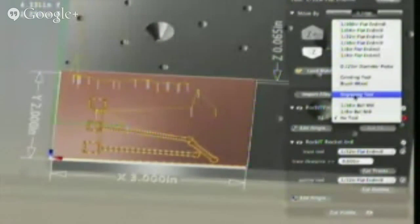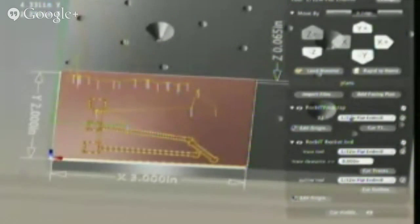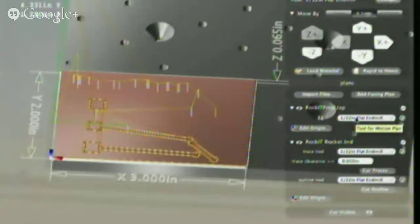So, we're going to import our logo file, which is right here. And that's a tap file, which Malcolm mentioned before. And tap is G-code. So we're going to select our tool, 1/32nd. And you'll notice it just has a tool selection because everything is built into the G-code. The only thing you tell it is what tool you're using, as opposed to the BRD file, where you can tell what the traces are, and you can drill the outline and the traces separately. So this just cuts the G-code.